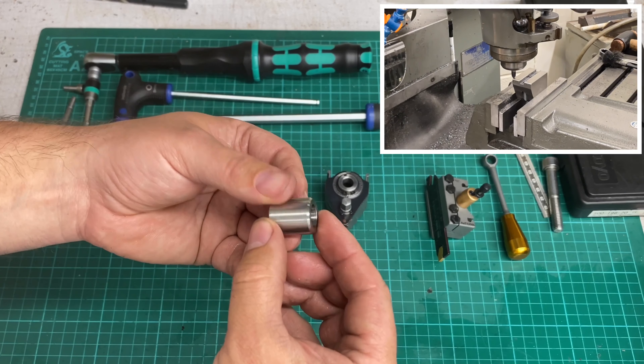What I'll do now is I'll nip that a little bit more. I'm going to square this up now, so let's set the dial gauge. That's where I want to be, so that when I wind the carriage that way I won't fall off the end of the tool holder. Let's see what we've got now - let's lock the carriage. It's not a million miles away because off camera I did put it somewhere close with a square. So that's within 100 microns there now.